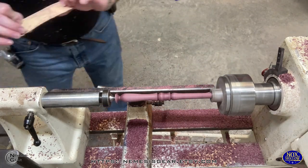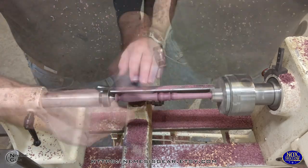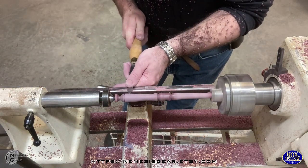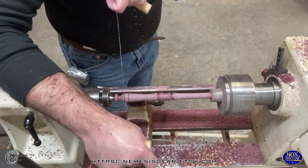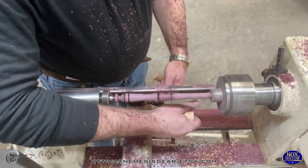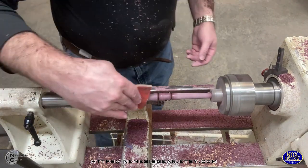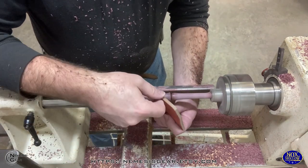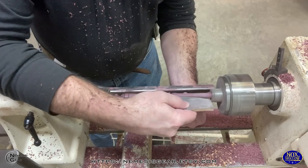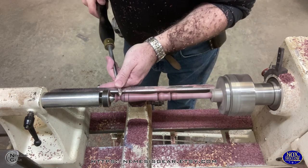You can see we're doing that kind of a vase shape there for the handle. I really like this shape — it's kind of an elongated tulip shape, which is what the guard area is. Then we'll do some wire burning to define some of the transition lines and get that charring brushed out. Then we'll start moving to some sanding, and I've got to take the tenon off the tailstock so we can finish getting that final handle shaped.